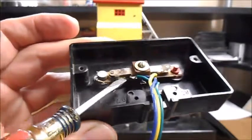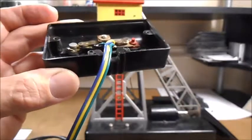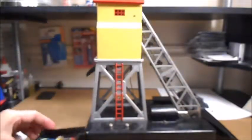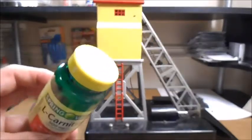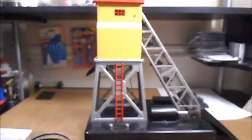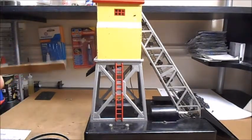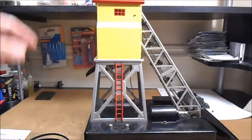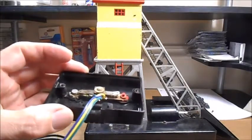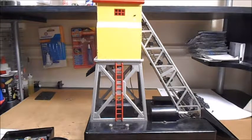That's what I did — I repaired this controller by cutting a little piece of plastic from a vitamin container lid. It was the perfect width. I also tried one of those little coffee stir sticks as an insulator, but it was too loose. With this guy repaired, I can now operate the buckets raising coal to the top without the dump chute operating.